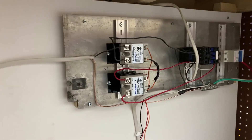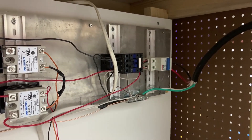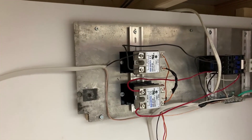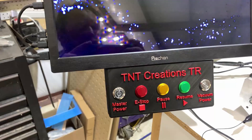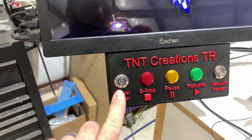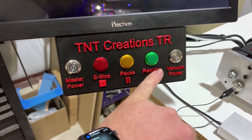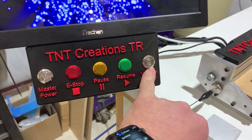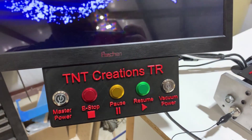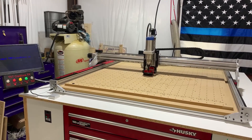We are using some solid state relays along with some magnetic relays. I'm using 12 volts to run my solid state relays, and those solid state relays run off the 12-volt switches up here on your control board. Your master switch basically turns everything on — these are wired directly into the demon controller. Your vacuum power is a 12-volt switch running to a solid state relay for your 120V vacuum. As far as the machine goes, it's pretty solid so far — I give it an A minus.